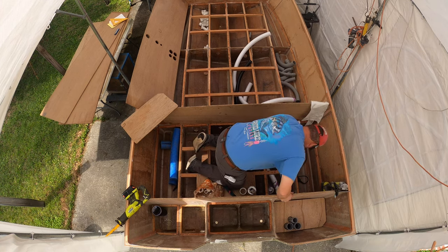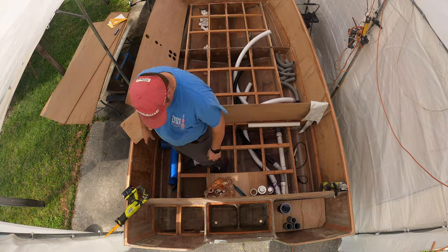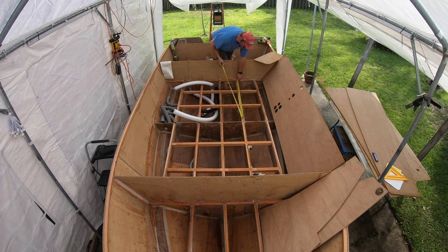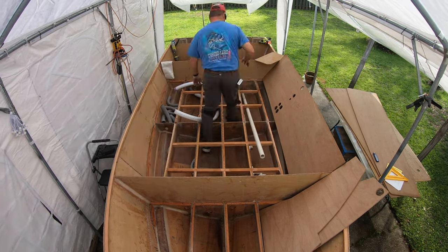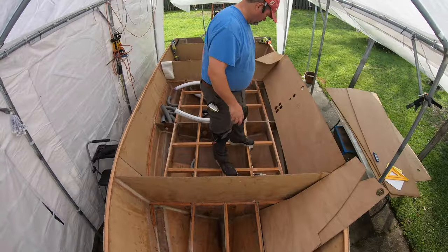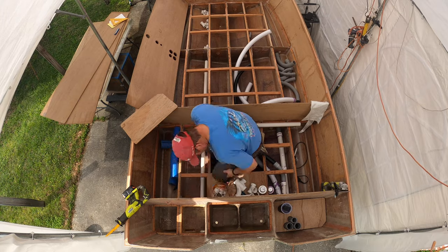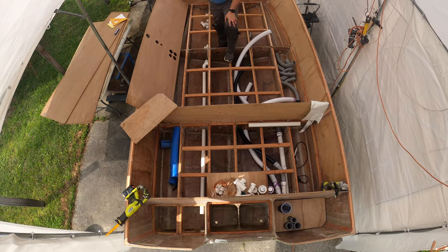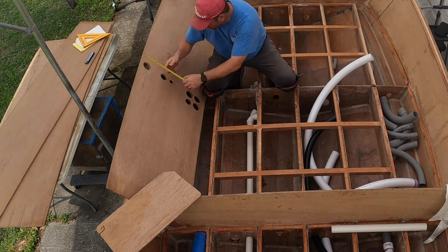And all those wiring chases, that's two inch chases and an additional inch and a half chase. That's way more than I should ever need. And you're going to see me put another 2-inch chase on the other side right here. And that's just a backup, just for whatever happens in the future. I'm putting too much in here. But once I seal this floor up and I put the foam in the floor, there's no option to come back and run this stuff. So that's why I'm trying to be very forward thinking and doing too much.